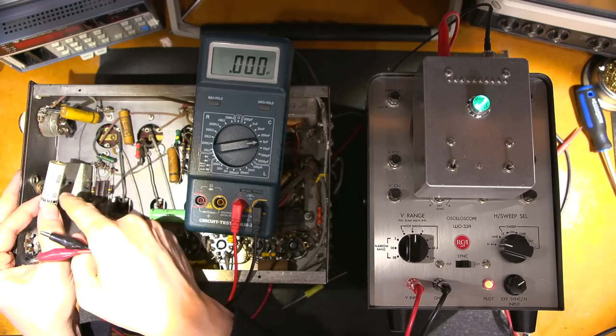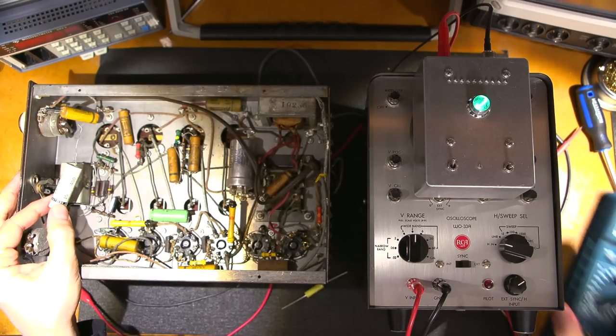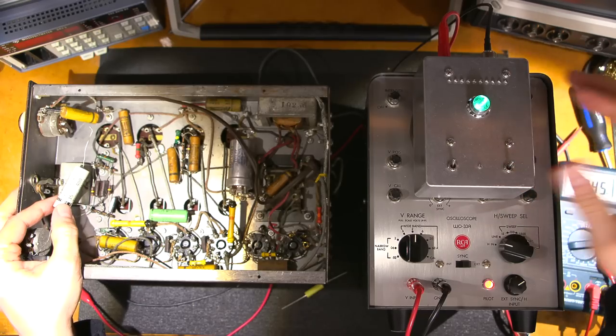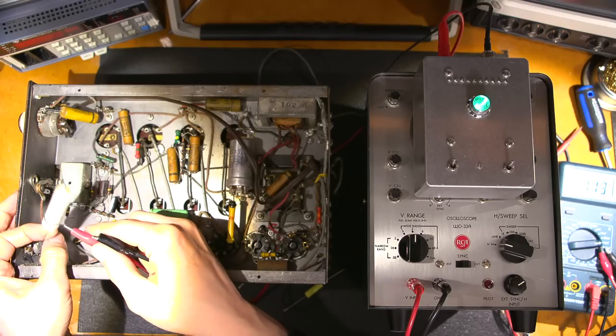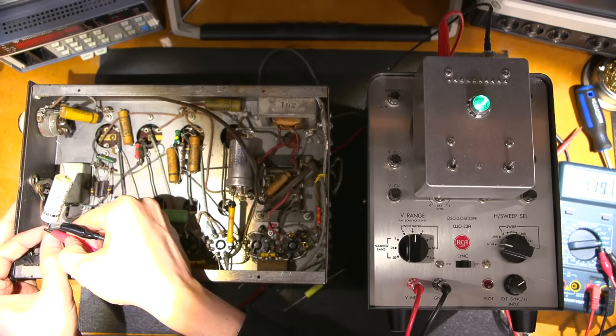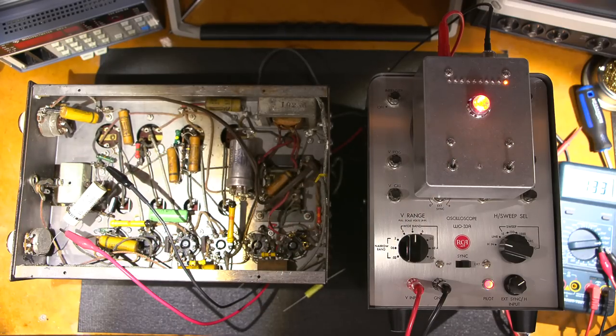Sometimes these capacitors will read very close to what they are, and they are still leaky. It's just that this one here looks abnormally leaky. So what I'll do here is just click this on to test. And this is an actual leakage tester, so this is going to look at this capacitor's leakage. So put the sense lead on here, and if this is not leaky, in a very short period of time, this should count down and that should go green. So we're talking in the range of about 10 seconds or something like that. And as you can see, it's just not budging.